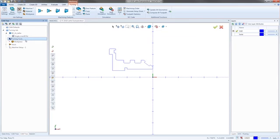Now, the proper way of doing your jobs, and this is for any job you do, the proper way to start the job is to set up the tools that you plan on using before you actually ever get there. And so I like to set up the tool crib. Now, I'll start by saying I do not even come close to setting this up every job. But jobs like this, I definitely want to set up, especially with the threading on the ID, the groove on the ID. I got to make sure I pick the right tool.